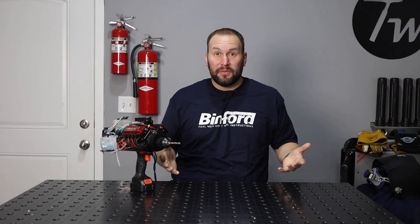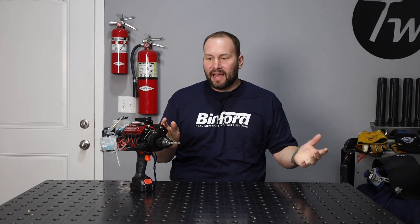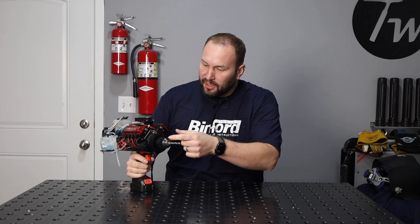That big heavy chuck wallowing around is making me a little bit nervous, so we need a different option. One thing that will help is reducing the mass of the overall chuck — I thought back to the cordless drill originally, and its chuck is much lighter weight. Also, bringing it up closer to the flywheel is going to help quite a bit to reduce vibration. So I'm going to try a different approach and make an adapter for the end of the crankshaft so I can just thread the chuck right onto it.